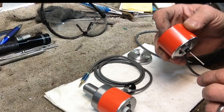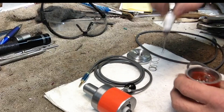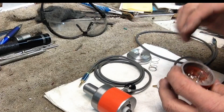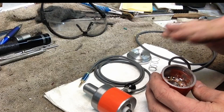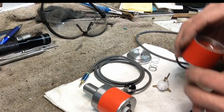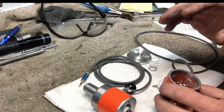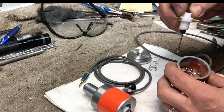The problem was the circuit board in the actual probe I was using. This is the other circuit board — I've marked it with a sharpie to show which set of alignment pins I wanted. When you solder your balls onto the circuit board, make sure they're seated completely in the hole and the spacing is right. The probe was wanting to stick between one pair of balls — it was probably off-center, not seated all the way into the hole. I just replaced it — I turned three of these boards, so I used the two good ones.